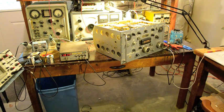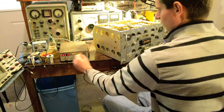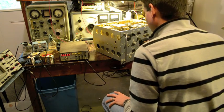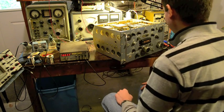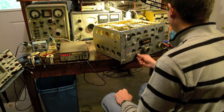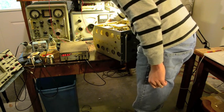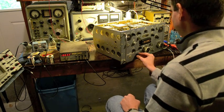I had some audio distortion problems in the audio amplifier chain — not quite sure what it is. I hooked up this signal generator right here, and I was hearing a little bit of crackling. I turned it up a lot and the crackling went away. I'm curious as to where that loose connection might be. I'm going to reconnect the diode detector and see if the crackling is gone.